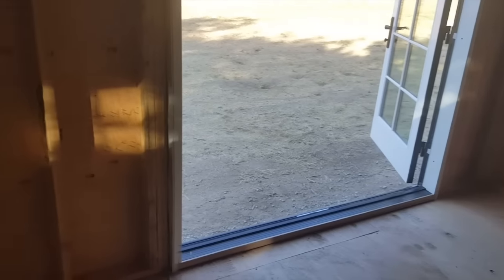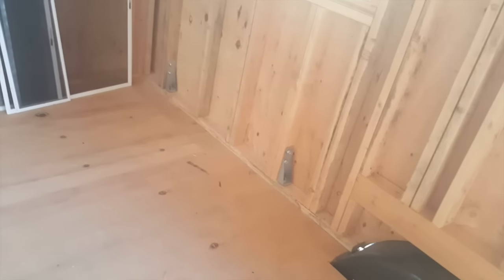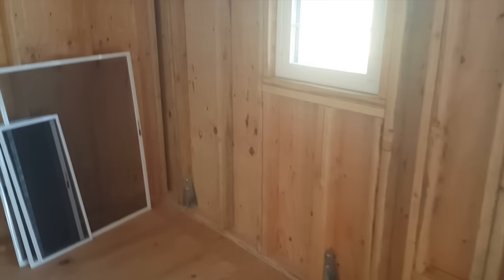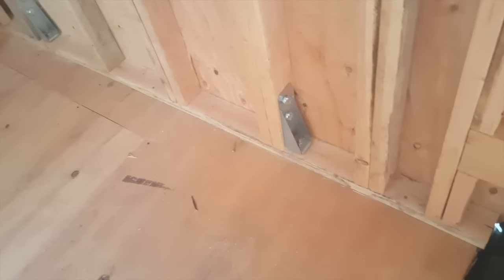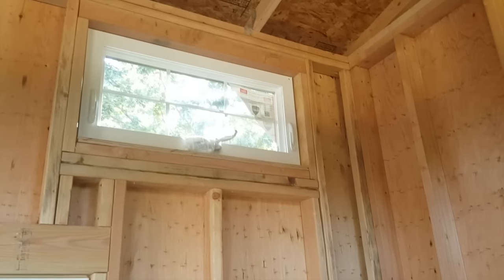These French doors are 6 feet wide — you can do 5 feet or 7 feet. You can even place them behind the wheel wells, but the limited space back there for a French door is about 5 feet. Here's a closer view of our Simpson HTT strong ties that we have on the king stud running all the way up to the top.